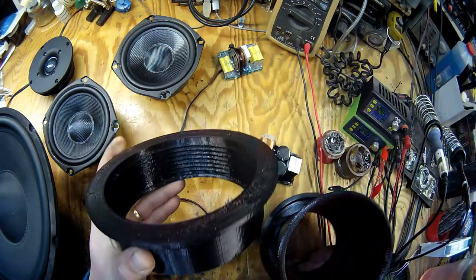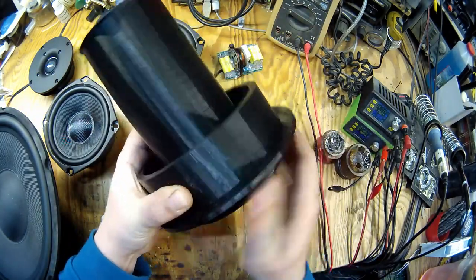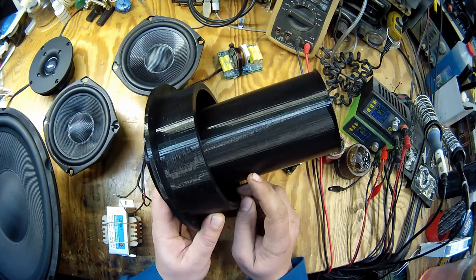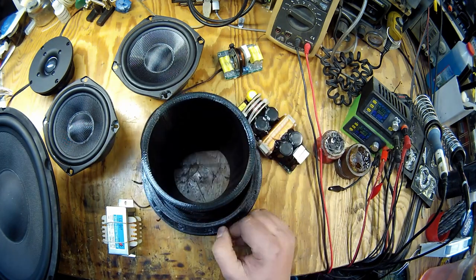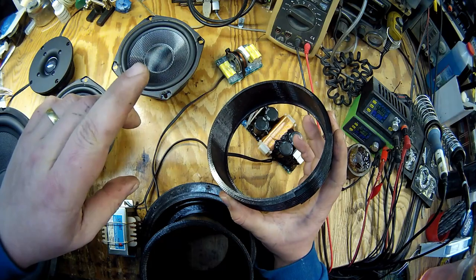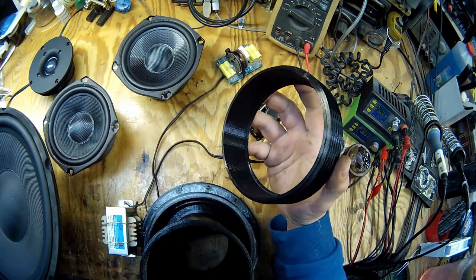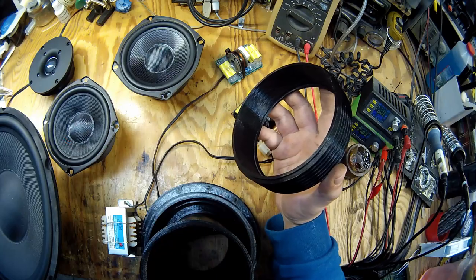This one is a screw-in, screw-out bass port or bass reflex tube, or call it however you want it. This allows me to change the tuning of the box depending on the situation. This long and thin one is tuning the box at some 28 to 30 Hz, giving me good low range, but if used with a subwoofer, I can just take a piece of drain pipe, and for this I've printed just the screw part. Now let's take a look how I've been making these.